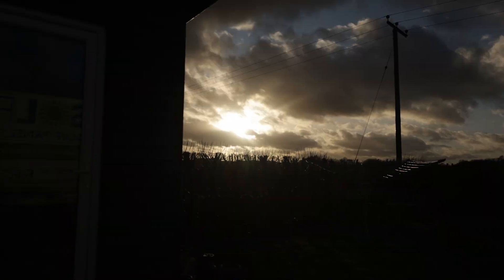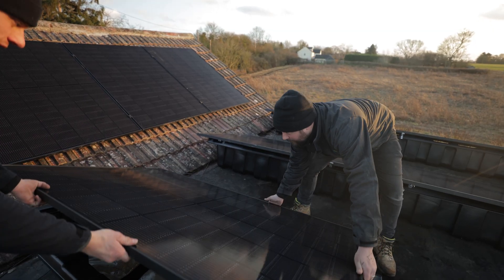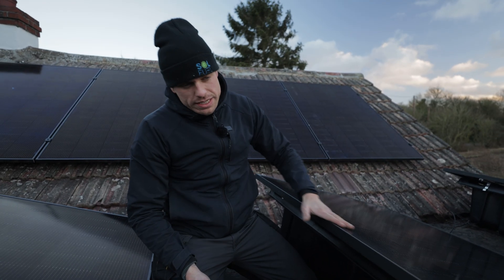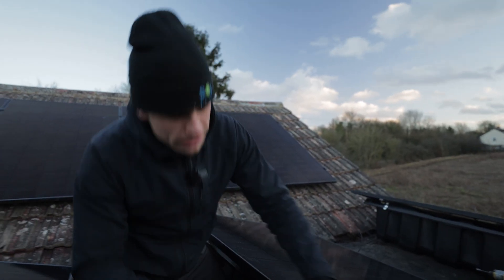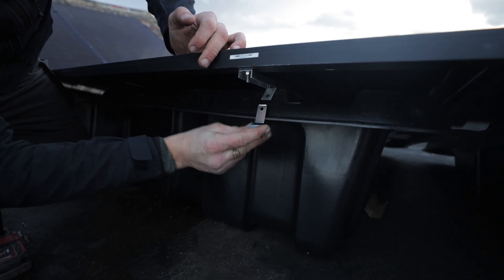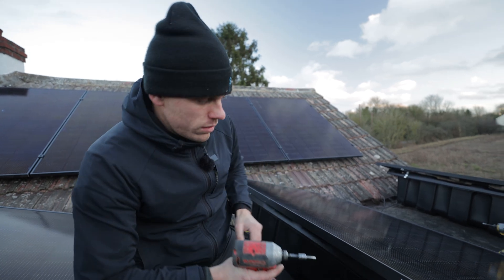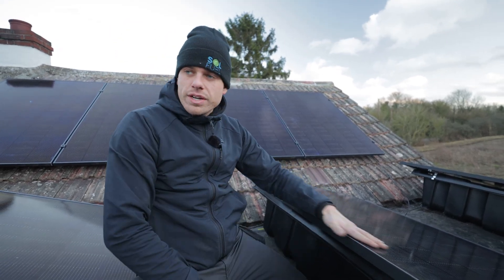It's a little bit of sunlight left, so it's a race to the finish to get it done before the sun drops. So earlier on when you see me fitting these braces to the underside of the panel — the way these panels are actually fixed onto the buckets, we use this little clip here. There's two either side, two on the front. It's got a shape on here that goes with the lip on the bucket. You've got two holes and then a hole on your strap here. You literally push the clip over the bucket there, then get a little hex screw — you've got to make sure this screw goes through all three holes, and that's how it locks in. That's nice and tight on there, and then we're ready to get the other three in the bucket.